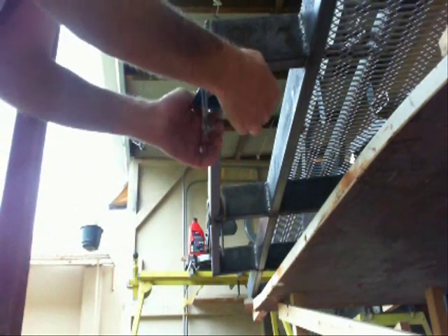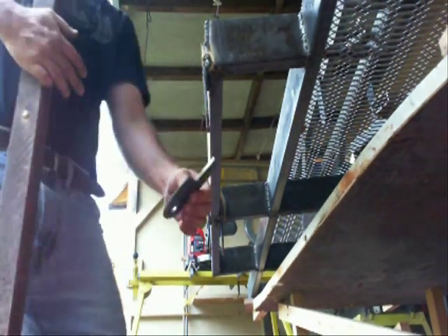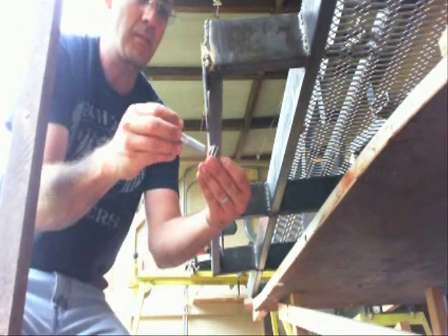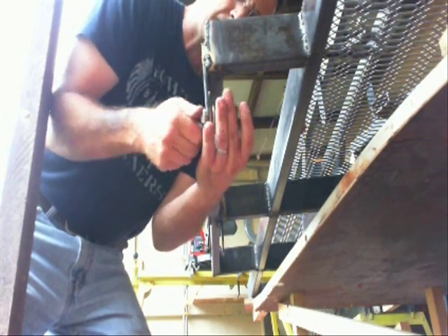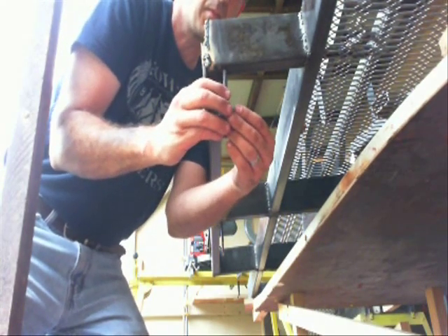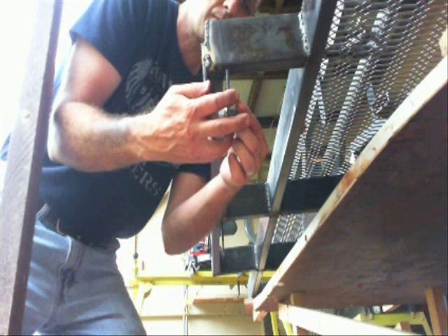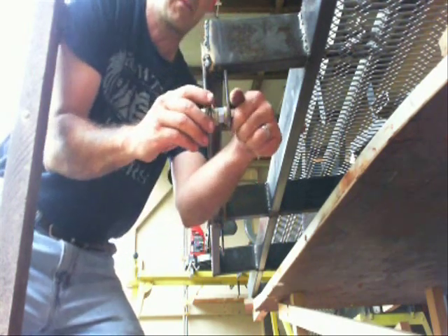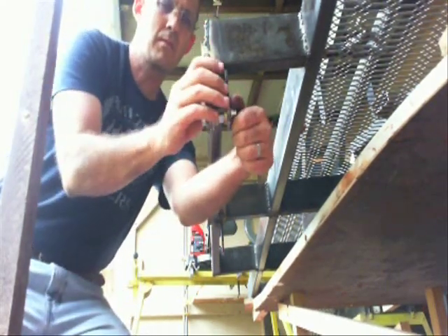This piece goes up directly across from the first support. To make everything straight, I clamped them together on the front and drilled the holes through the front — that gave me the holes exactly in the right position. Then I take a bolt with some spacers and bolt the other piece on there, which ensures the holes are perfectly lined up. I bolt the other side on, tighten it up, and then I'm able to come back on top and weld it in position with the holes perfectly aligned.